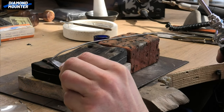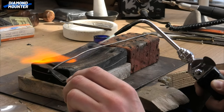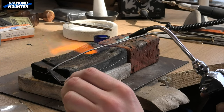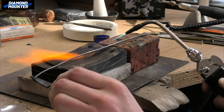Silver is quite easy to anneal - only needs to reach cherry red, like what I just did - that was annealed. Have your flame going along the length of the piece to get maximum benefit from all the heat. If you hold the flame the other way you're annealing it but wasting a lot of heat. You'll probably do a quicker, better job holding it along the piece - so keep the flame moving.